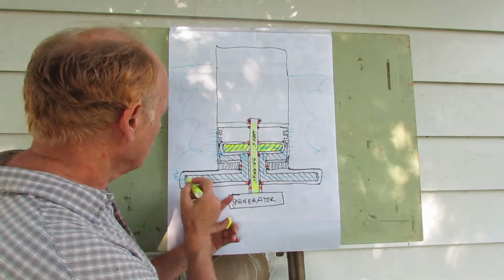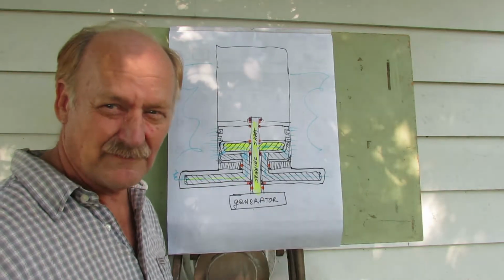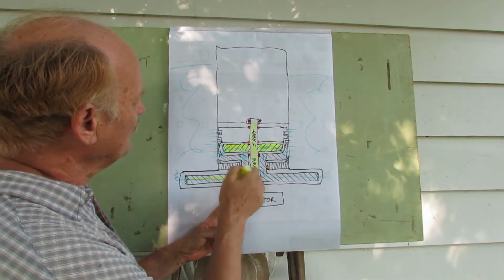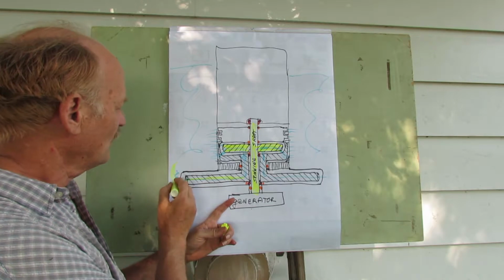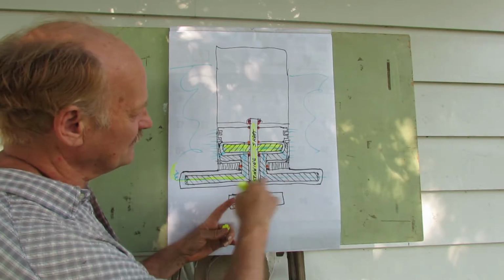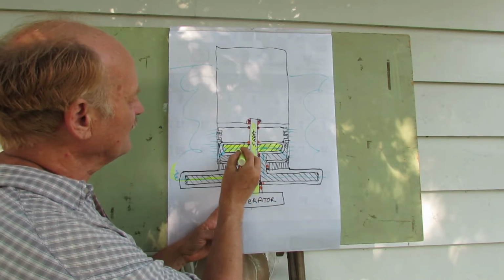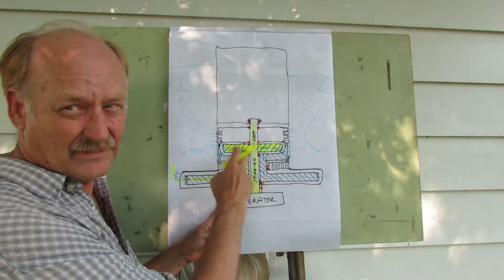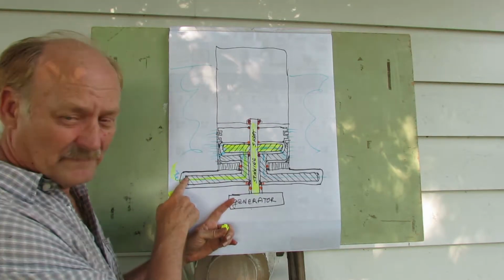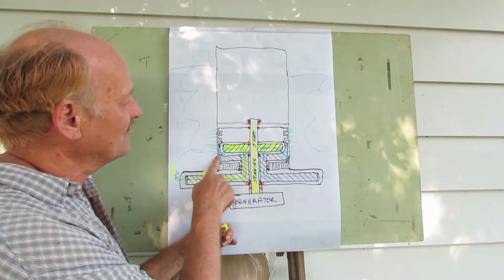So then we have this turbine down here, this rotating turbine. This is a cutaway view. It just gives you a half source. So like the blue here, this is all water. These are ports here, so water comes in here. It turns this impeller, this rotating turbine, and it forces water. The pressure of the water comes up here and it engages into this generator impeller here that turns the generator. So this arm is substantially bigger. It creates a lever action against this valving assembly up here.